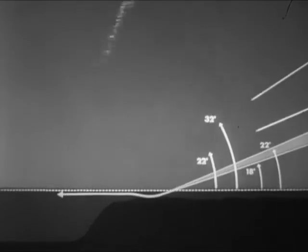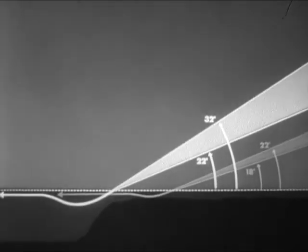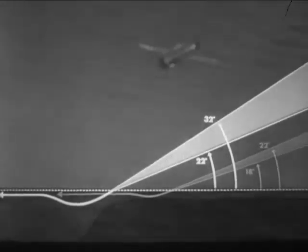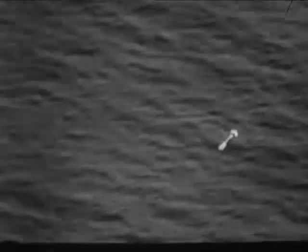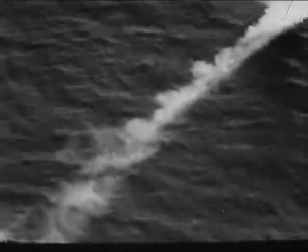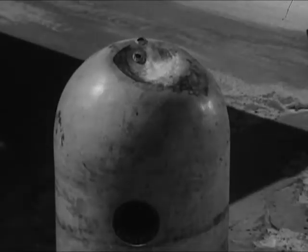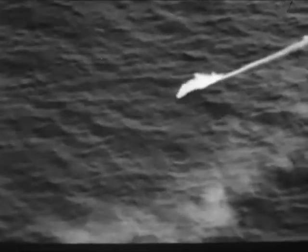The full range of entrance angles is 18 to 22 degrees for shallow water, 22 to 32 degrees for open sea or deep water. Naturally, the extremes should be avoided if possible. If an entrance angle under 18 degrees is obtained — say 12 degrees — the result of a speed-altitude combination of 200 knots and 80 feet altitude — the torpedo may be seriously damaged and ricochet or broach violently. If the controls are damaged, as they probably will be, the torpedo may sink or at least have an unsatisfactory run.